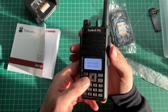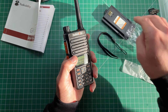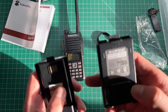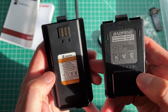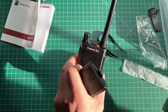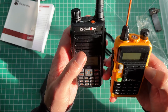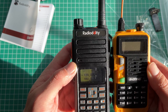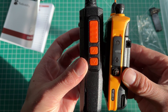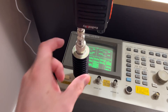This radio claims 10 watts, which is pretty cool for a handheld. The batteries are 2.2 amp-hour at 7.4 volts — quite beefy compared to a Baofeng's 1800 milliamp-hour battery, so you get an extra 400 milliamp hours. The radio is quite a lot larger than a Baofeng, but it does feel a lot sturdier in your hand. Compared to my UV S9 Plus, it's not that much bigger — not too bad.